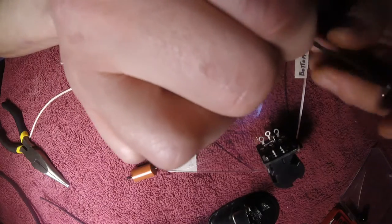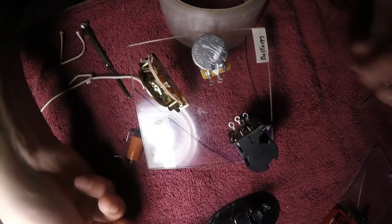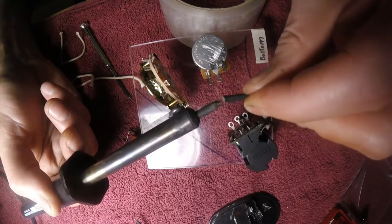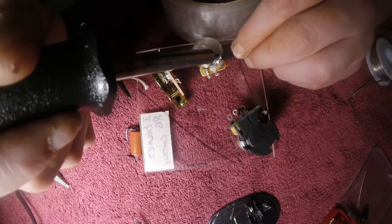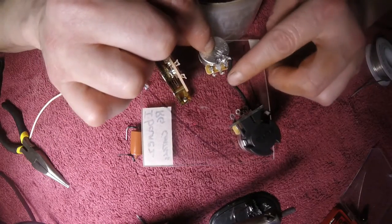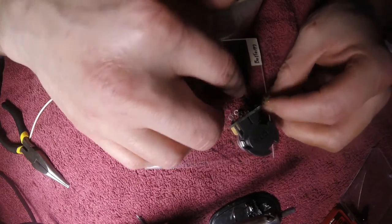So you've got a ground here grounding back to the back of the tone pot. This comes directly off of the volume pot. What I'm going to do is load a little bit of solder onto the end of my soldering iron — that allows me to put it right where I want it. I'll put it right on the end of that wire, then take that wire back to our grounding spot, heat that up, and boom. Give it a tug, make sure she's tight. The great thing about these jigs is you can rig everything up nice and tight. It sits into your cavity of your 570 tight, sits next to your pickguard very tight.